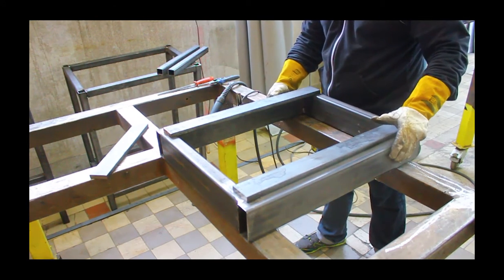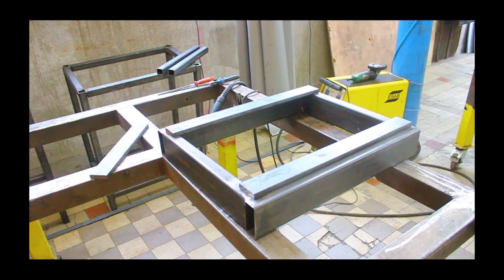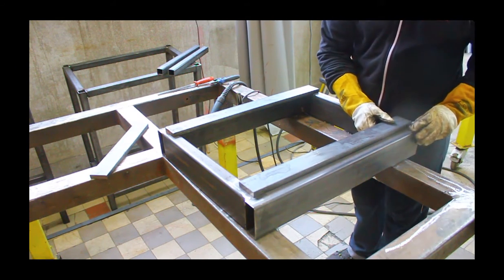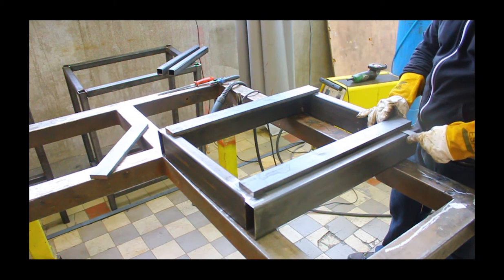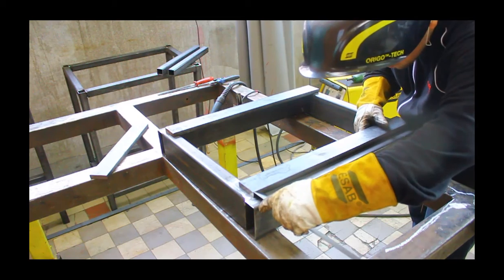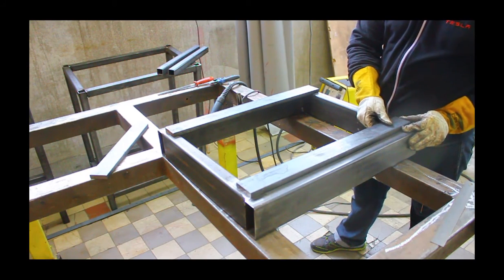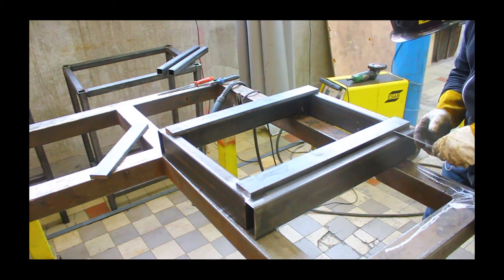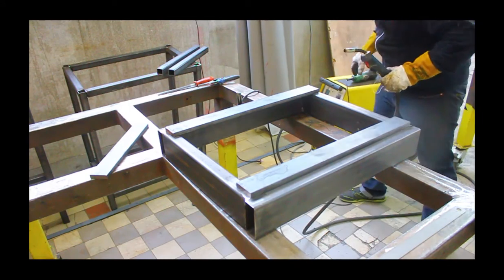When it's finished, the work cube of the machine should be around 550mm in length, 200mm in width, and about 390mm in height. If I get it anywhere close to that, it's going to be a very good surface grinder. I mostly do finishing work and don't take heavy cuts, so it should work with my needs quite well.